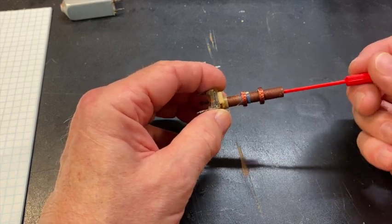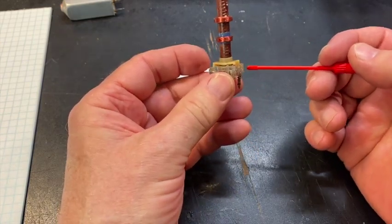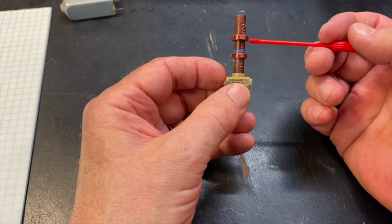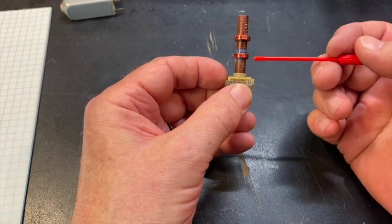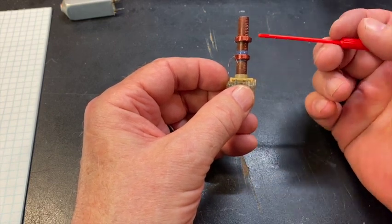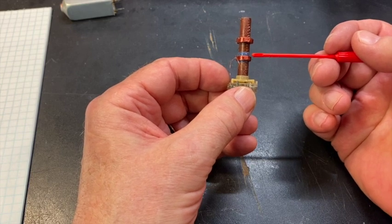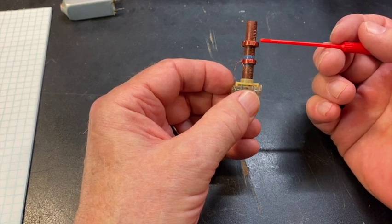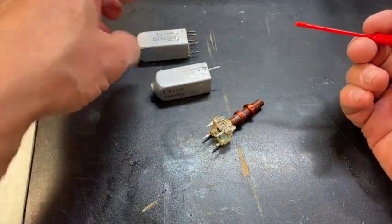What you're doing when you do this is you're changing the resonant frequency of this coil and its counterpart capacitor in the base. So these are adjusted to 455 kilohertz in this case, when you adjust the slug's position inside this secondary coil. To make this work best, you need the resonant frequency of this coil and its capacitor, and this coil and its capacitor, to be exactly the same frequency. That way, this coil can induct the maximum amount of voltage into this coil, and you get more out. This one works the same way, it just doesn't amplify, as I said before.